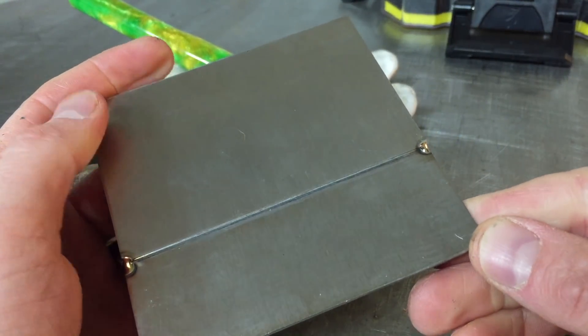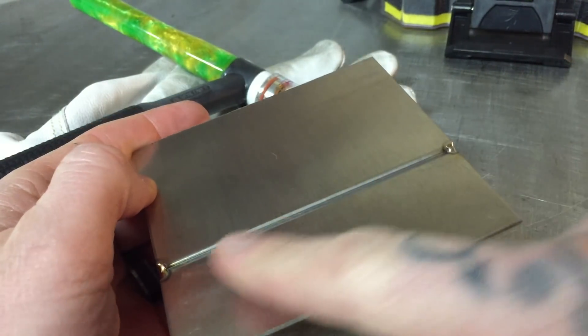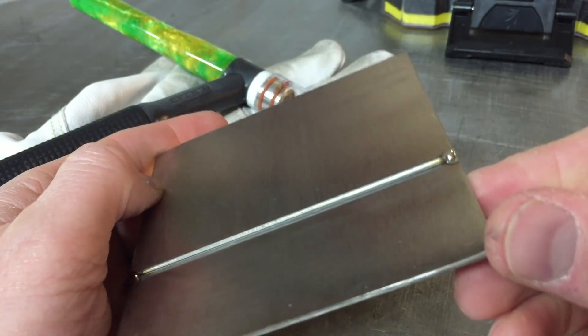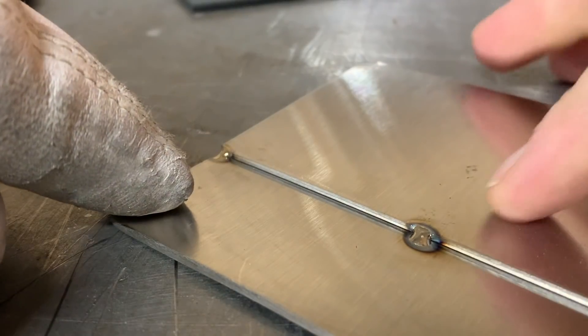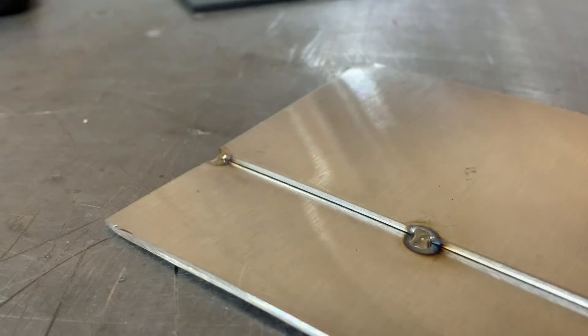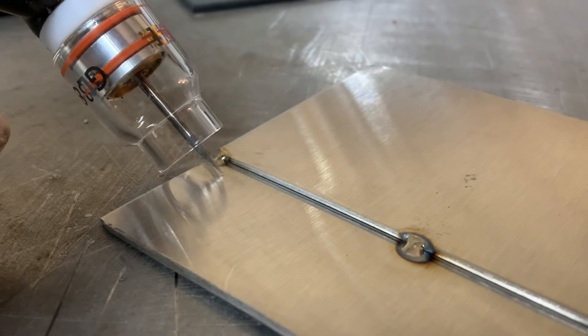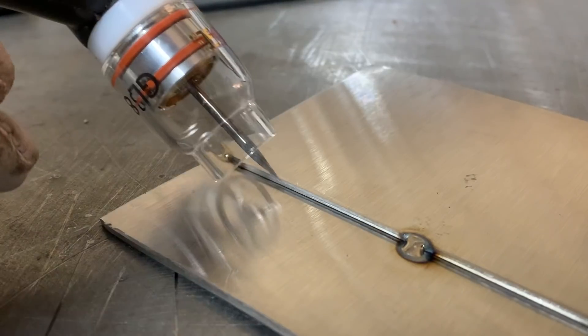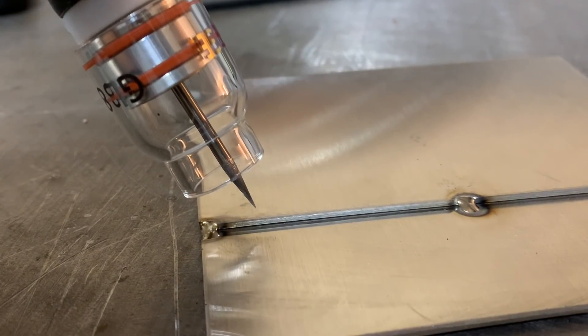These plates have been prepped. I'm going to wipe them down with lacquer thinner real quick. I'll probably put another tack in the center here just to make sure that as I start welding from one end, it's not going to bow up and create a gap. Now that we have good tacks to start and end at, make sure our fit-up is pretty tight — the two plates are laying flat on top of each other. I'm going to focus my heat slightly above the weld joint, because if we're aiming too low, gravity will pull the puddle down. We'll travel left to right. Torch angle is roughly 15 to 20 degrees.